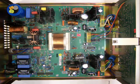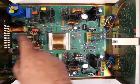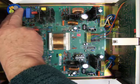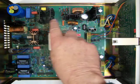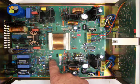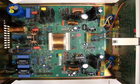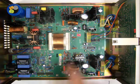A lot of CE regulations require power supplies over a certain size to have this feature. But what that means is, for this thing to even start to work, this amount of electronics has to work, which powers the capacitor. That capacitor involves the inverter that powers this transformer, and a tap off this goes into this little power supply here that powers the circuit again. So the chip will have an initial start power that's run right off the power line. It's enough to charge a capacitor and get the chip working, but it has to sustain itself.